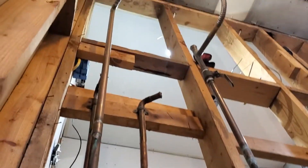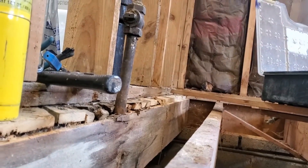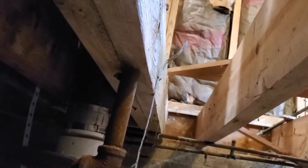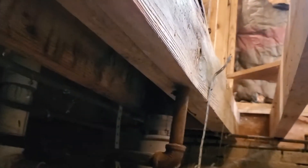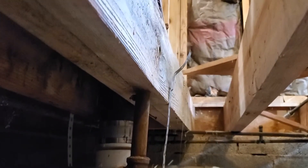What you see here are the main lines bringing water to what used to be a water heater, and over there you're going to see the natural gas line. But look what these irresponsible guys did — they went through the entire 2x10 beam with these pipes, right in the middle. If you know a little bit of carpentry or construction, or just common sense, when you perforate an entire beam like that, you're taking away the entire strength of that joist.